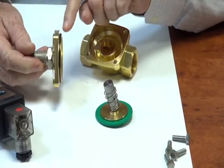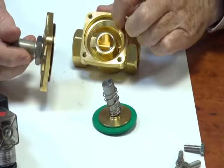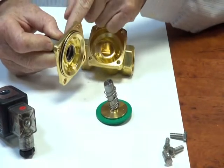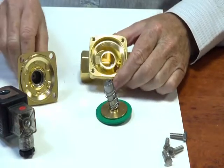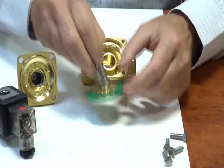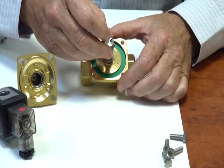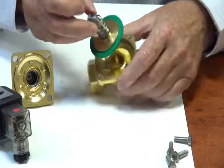The body has a body o-ring for the seal at the top. Inside there's another Viton backing ring as well as a metal seat, so it's a double sealed effect. This here is the flow path through the valve.